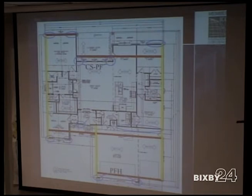This one only needed 4 feet of bracing on that wall. So you've got more than enough there based on your height. A 5 foot opening on an 8 foot plate height, I think you needed 24 inches, yeah, you need 24 inches, and you have 54 inches on each side. So one, you've got enough bracing, you're within 12.5 feet from each end, and they're less than 25 feet apart. So you're good to go there.